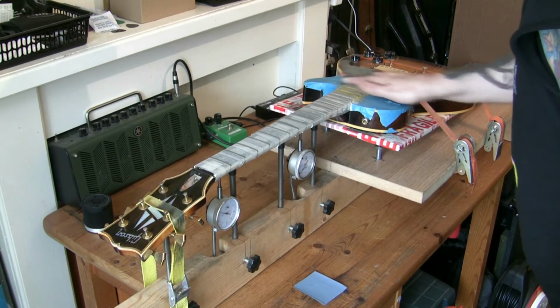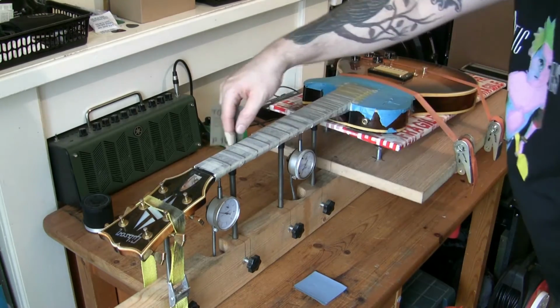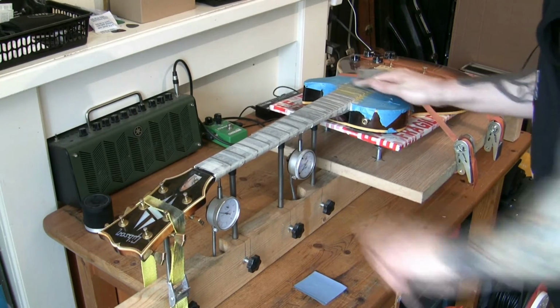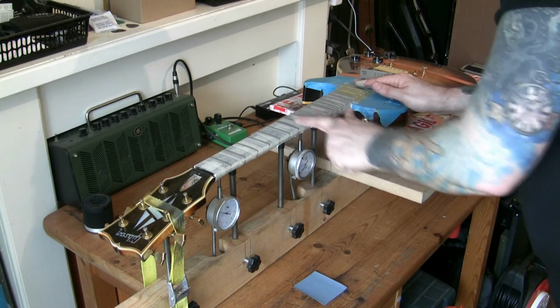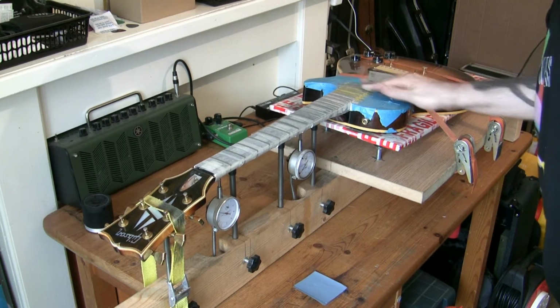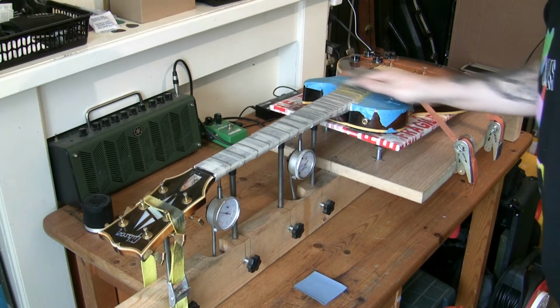and I'll do all 22 frets, and I'll do it this way from this side, then I'll turn the bench around or the jig round, and I'll do it from that side as well. And I'll do this for all 22 frets, both sides, get right in the corner, and we're going to polish out the scratches I've put in this way. I'm going to polish out that way with 4 different grits of paper. So really you're going to get 8 polishes with this, 4 grits of paper, 2 ways. And that's it, that's one done, I'll move on to the next one.